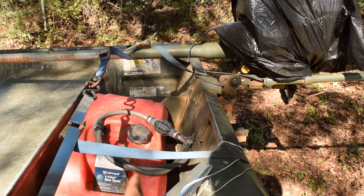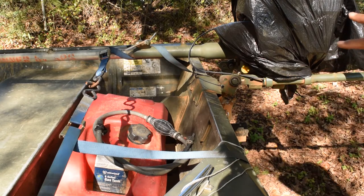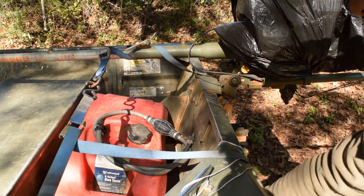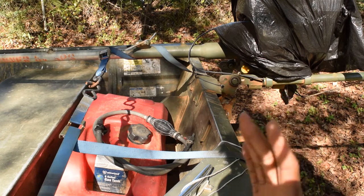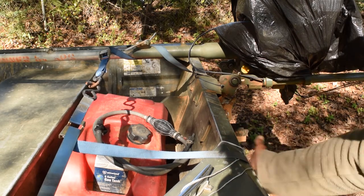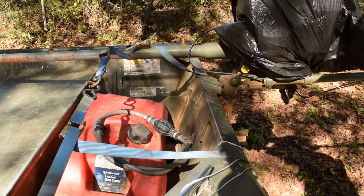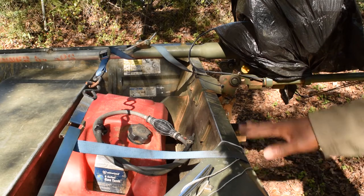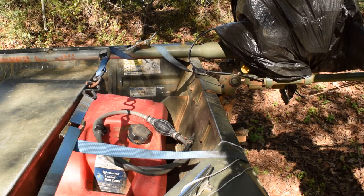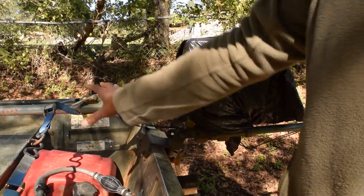If you see this transom, it is tilted backward. That is to accommodate traditional outboards that completely hang off the entire back of the engine. If the transom were plumb, you would always have that engine banging up against the boat, and that's not healthy. You'll damage the boat. But in this type of boat, with this type of motor, the propeller's 7 feet behind the boat, so we don't need this tilt.